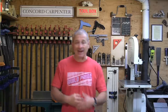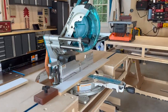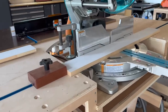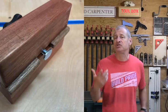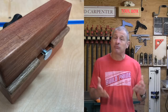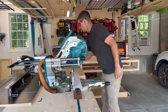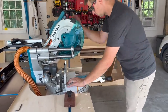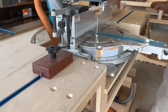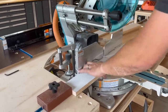The last feature I want to talk about here is a positive stop system. When you're making multiple cuts the exact same length, it's a great way to be accurate — basically a stop block — and it can be a huge time saver and really improve your repeatable accuracy of cuts. To accomplish this, we set up Universal T-Track from Rockler and made a pair of stop blocks from some spare mahogany and track hardware. The T-Track is a fantastic, versatile solution with endless uses in the shop. To mount the T-Track, we made a few passes with a router and a three-quarter-inch dado bit, then put the track into the dado and flush-mounted it, slightly less than flush.